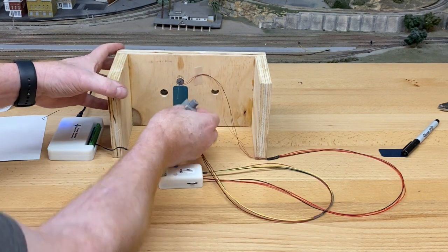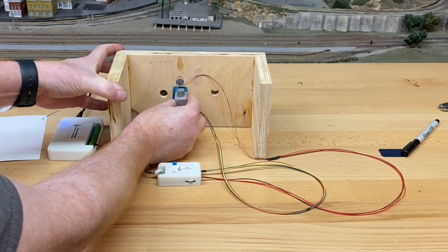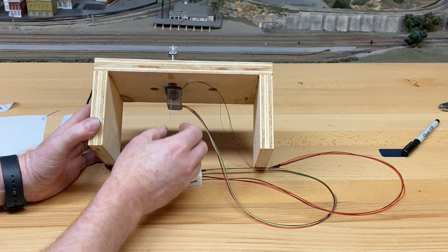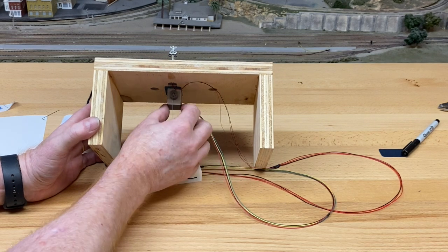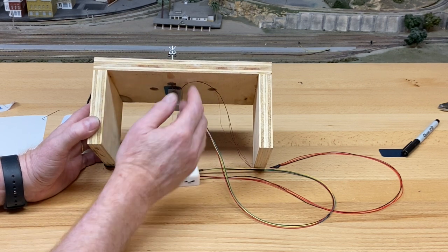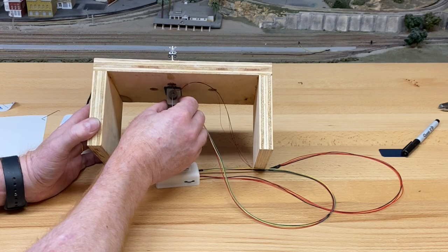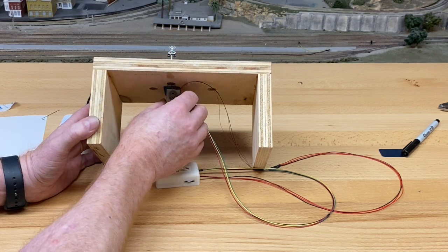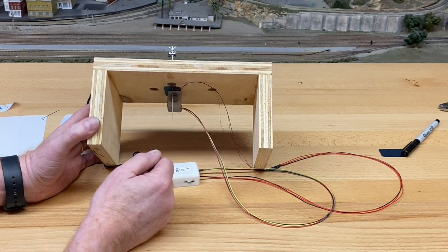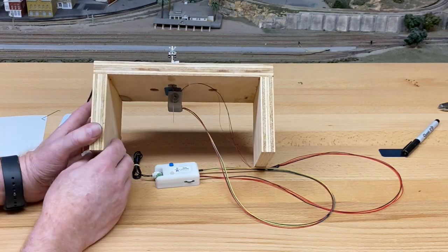And as I said, we love magnets here at Model Train Technology, and the motor slides around a little bit and it will feed into there. Now, what we're going to do is bend the rod so it fits into one of these holes, and when the motor turns, the arm goes up and down, okay? And we want to have a bias a little bit away from the arm, particularly for the 1-inch plug. So just move it slightly off center. It'll work in pretty much a whole bunch of situations here, forward and back. It's pretty flexible. And even if the arm gets too much, the arm may push the motor off the pad. And we'll do that sort of as a fail safe so it doesn't break it. So that's quite an interesting design feature that we built in.